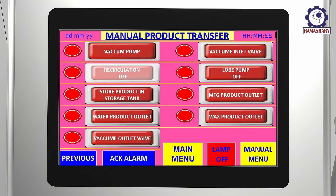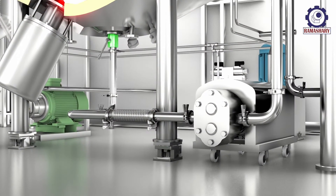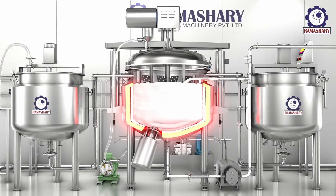Start the load pump. Turn on the inline valves for the recirculation process of the product. Now supply cooling water to the jacket to cool down the final product.